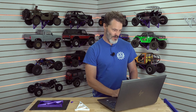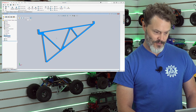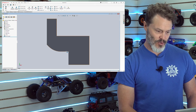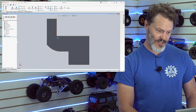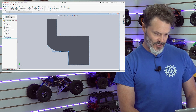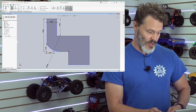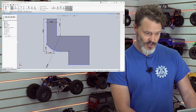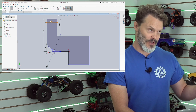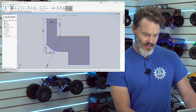Let's open the drawing I made for the bracket test — this is called bracket test. Here is our file. As you can see we have a rounded edge down here, and this is actually the profile that I'm following for the internal of the slats. I did a pretty simple sketch in two dimensions. I used smart dimensions to make this exact and to make it so it wouldn't change whenever I made adjustments. We have 10mm top to bottom of this little hook, 5.8mm depth — which is the depth of the actual slats or the slots in the slats — then 19mm for roughly the width.